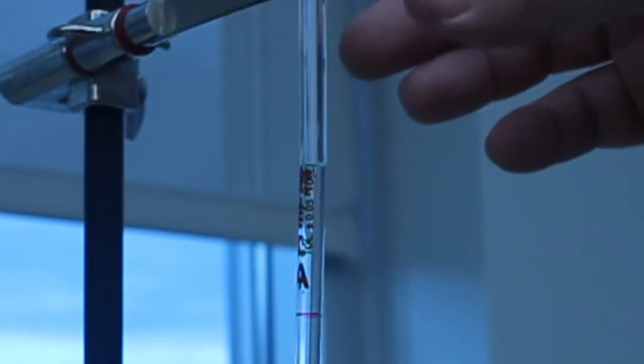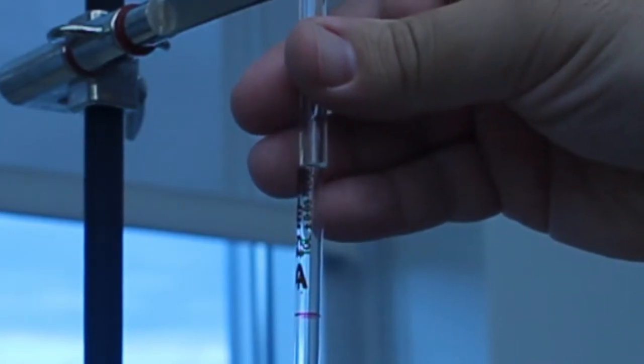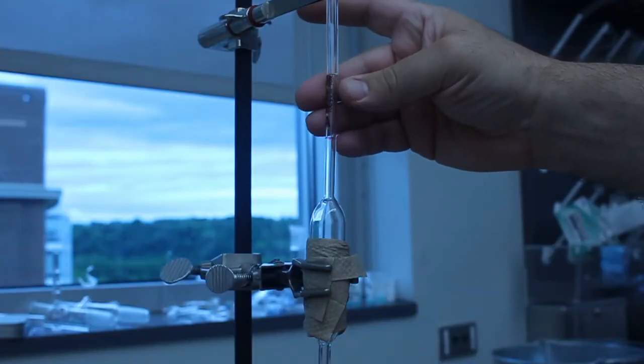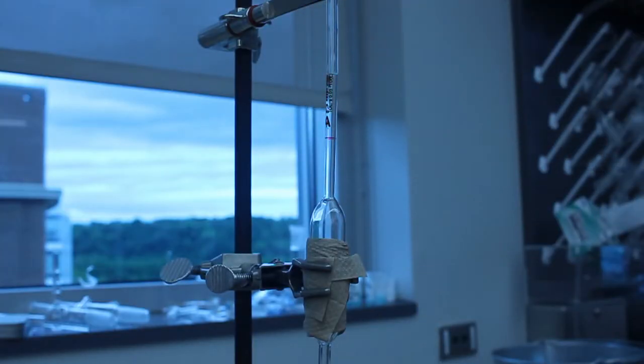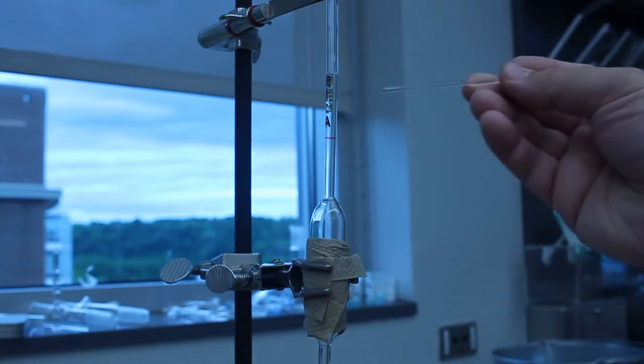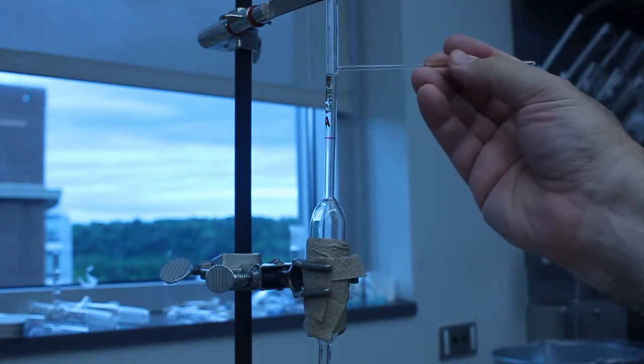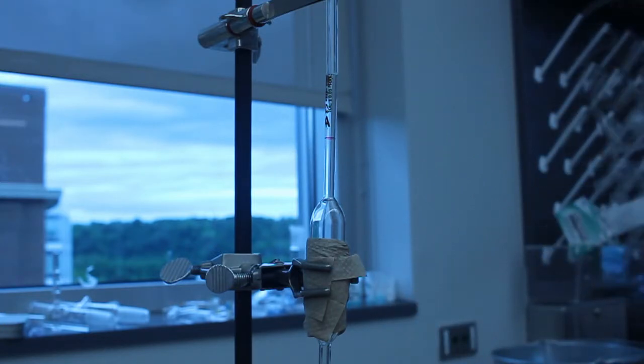So rather than do that, I'm essentially going to get these two pieces of glass tubing in contact with each other while they're cold, tack them, and then go from there. And one of the things that might become an issue is, if I have an air gap, in other words, if I have a bubble between these two pieces of tubing, I can come in with this 3 millimeter rod and add a little bit of extra glass. Or, if I need to move some of the glass, I can use my tungsten pick.